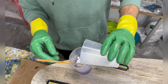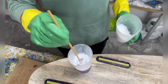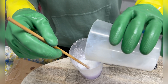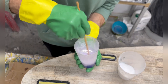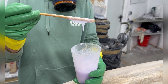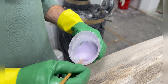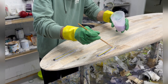So you've got the time with epoxy — use the time. Here we have the silica powder we always use for a really light sealing: a 50/50 mix by volume, not by weight. Add the same amount in volume as the epoxy in your cup, then mix it well. Don't add a lot of bubbles — always mix without making a coffee foam. Less bubbles means better connection, more strength, and fewer issues.